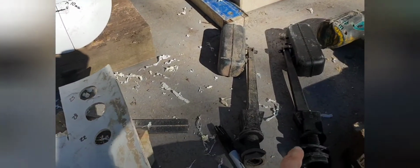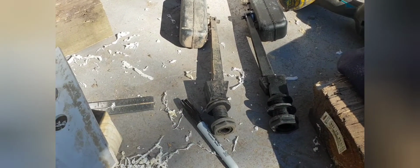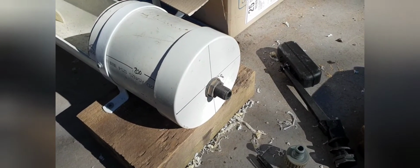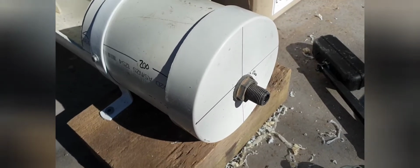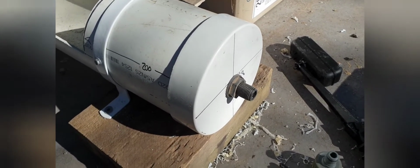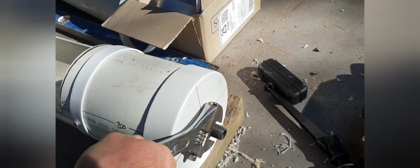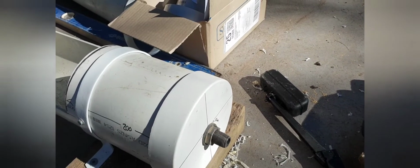Okay, and then we're going to drill our hole and set up our float. I'll point out that little rubber O-ring just there is very important. Do not lose the rubber O-ring. Alright, we've drilled our hole and we've put the float in. Notice the float's standing up that way there. We've cut the hole, we've got our 1/2 inch float on there, and you can see the way the float's standing up there, and then use your shifter to tighten that up. But keep in mind, that's just plastic, it's just nylon, so if you put too much pressure on it, you're going to break it. So be very gentle with it, tightening it up, just as firm as okay.